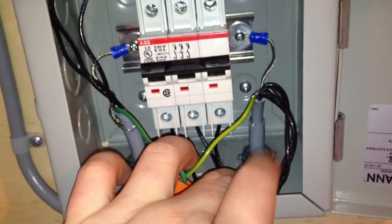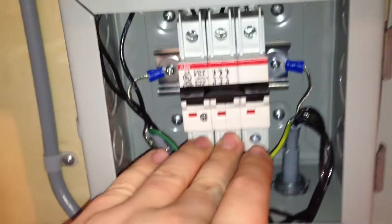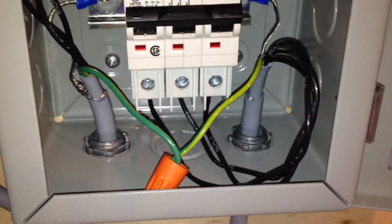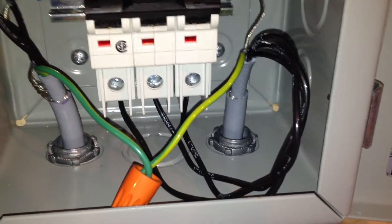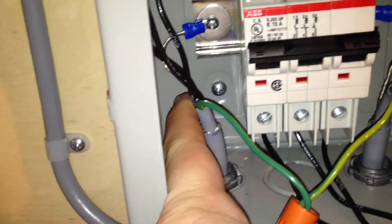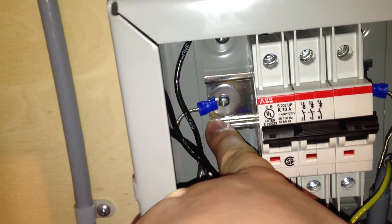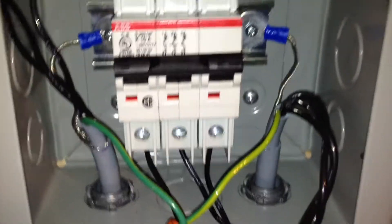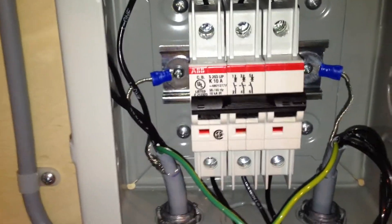That line comes in — these are the three power lines coming in to the breaker. Then it comes out through this line, which comes up to the cable tray and goes out. This cable is not ordinary cable. Everything is stranded, it's rated for continuous flex, it is shielded, and I've taken the shielding wires off and connected them to the DIN rail on either side.